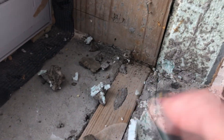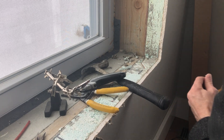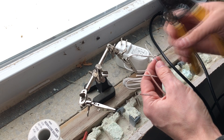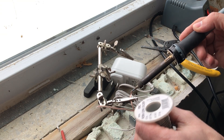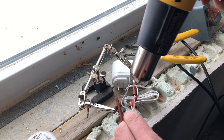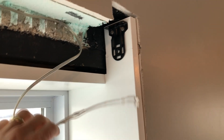Then I just need to cut a groove in the foam to make sure that the wire doesn't get caught by the sill when I slide the sill in. Just dig that out with a utility knife and a screwdriver to make a little channel for it. Once I slide that in and get it pulled tight I can seat it with a little bit of hot glue and we're good to go. Now all I have to do is follow the same process for the plug end — strip the wires, solder them up, put a little bit of shrink tube over them, and we'll have our plug connected from the basement all the way up to the blinds upstairs. That process was really pretty easy and it worked really well. Next we'll install the trim and the solar shades — I'll do a couple of videos to show you how I did that. So stick around and check them out. I'll see you next time.